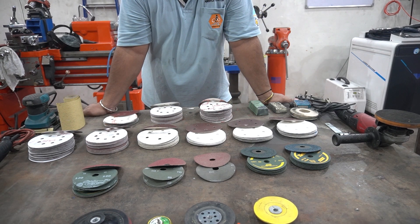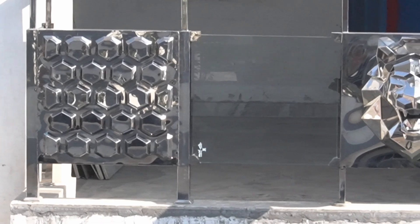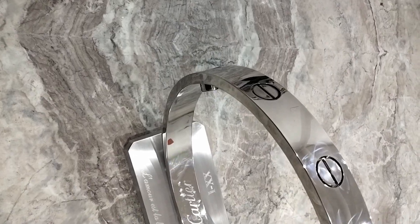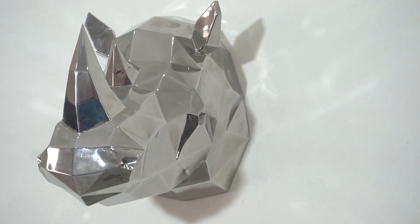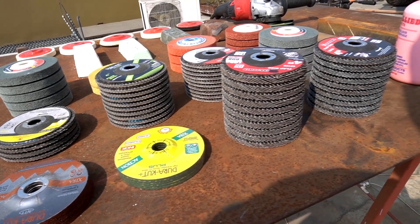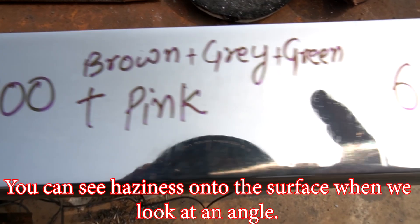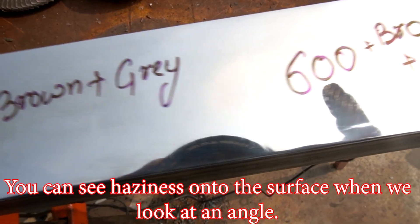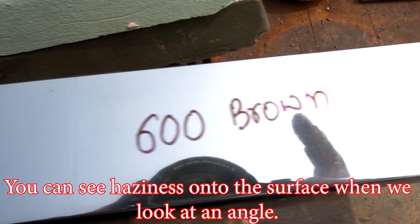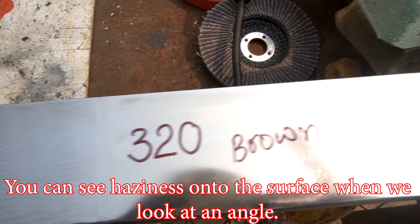Welcome back to the channel. In this video I'm going to show you how you can do mirror polish onto stainless steel. We do a lot of decorative work with stainless and often some of it has to be mirror polished. I already made a video on this topic in the past — the major difference is that in our previous video we used flap wheels, while in this video we are using velcro type discs. A major disadvantage of flap wheels is that they leave gouging marks onto the metal surface, and once finished these gouges are visible with the naked eye. As a seller I always want my product to look premium, which is why I switched to velcro pads.